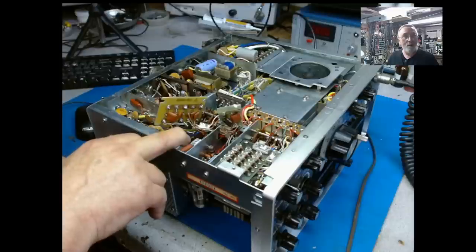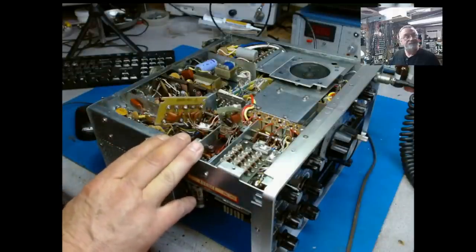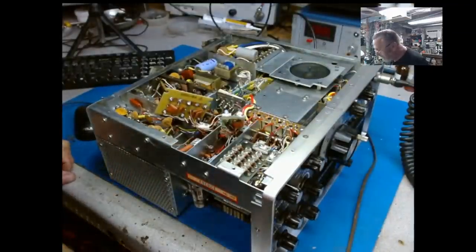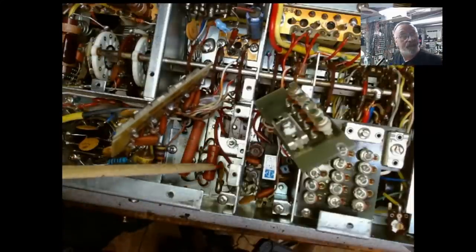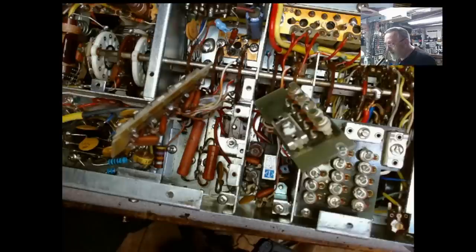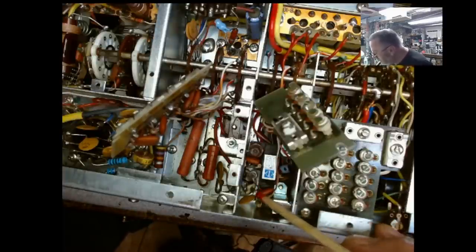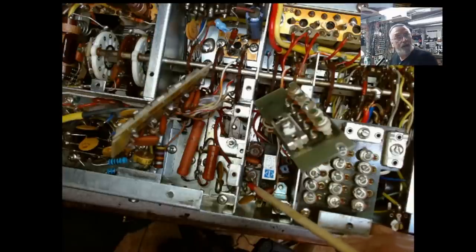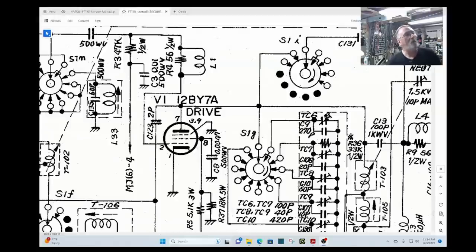So as you can see I raised the two boards up here so I can get down at the bottom of the tube and have a better look at it. You can see the bottom of the tube right here, and pin 2 is the bias pin. When I got in here and started looking, there's a coil — another inductor. That coil happens to be L1, and you can see it snakes down to pin 2 of the driver tube. That's where we get our minus 20 volts for our bias on the driver tube.